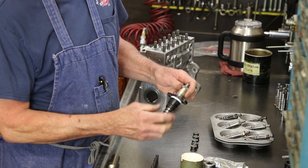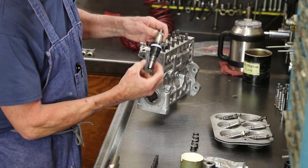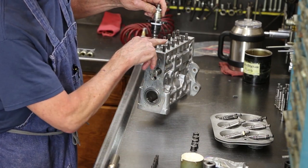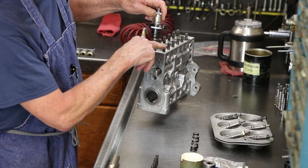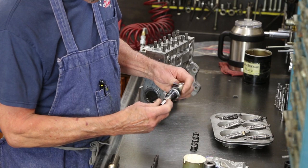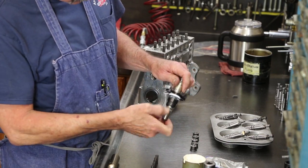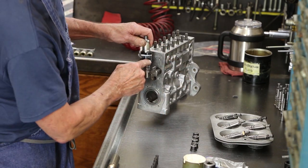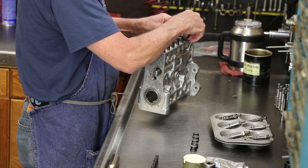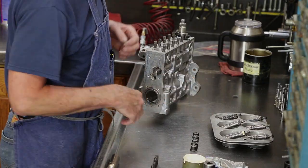This particular unit here, the top O-ring keeps fuel from escaping to the exterior. Two bottom O-rings keep the fuel from getting into the engine oil. From here on up is all fuel. There down is engine oil. Grease to keep them from getting cut. Locating pin. Control rack side. For now, I'll just set it in the housing. And on to the rest.